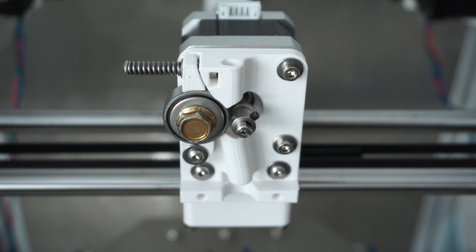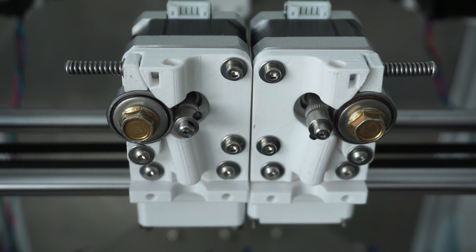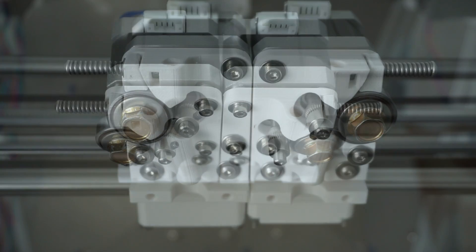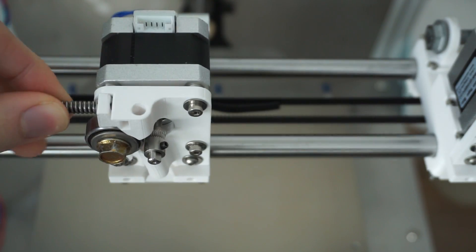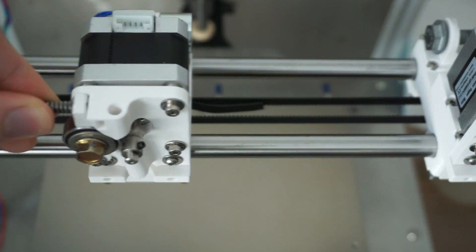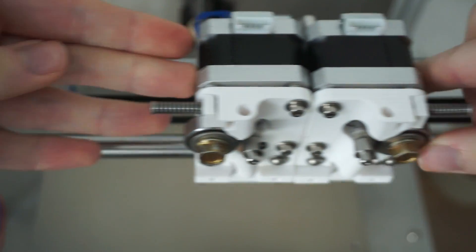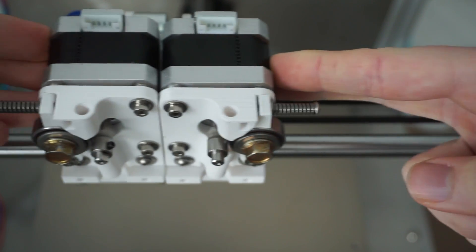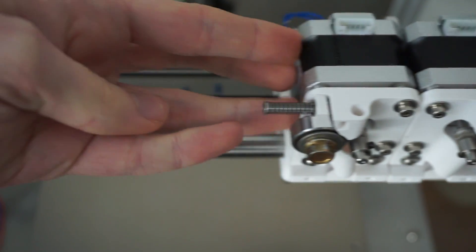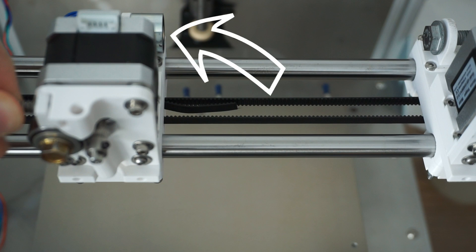This seems like a nice printhead, but do you know what's even better than one good looking printhead? Two good looking printheads. My plan is to use the left one as a master printhead, so whenever I'm running a print which only needs one extruder, just this one will be active. In case I need two extruders, the master can clamp to the slave printhead, use it to print with a second material, and move it back to its parking position when it has finished. This clamping is done by using the electromagnet in the back of the carriage.